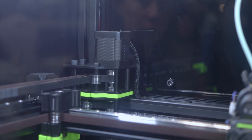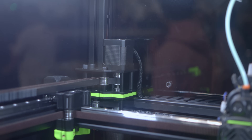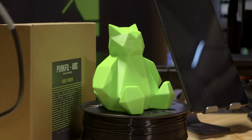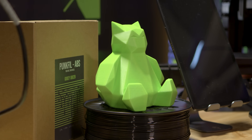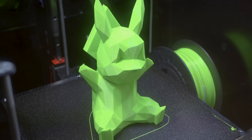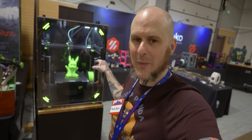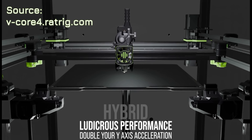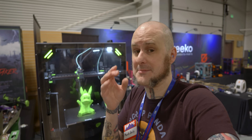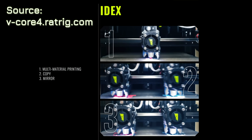To me, it seems like a bit of black magic how they're integrating two technically separate motion systems into one axis on a machine, but they've got it running here and running well. This machine is not heavily tuned — it's a prototype unit on display here at the show — but I'm not seeing any major VFA or ghosting or anything like that from these two different motion systems interacting with each other. And since you have those additional belt paths and additional motors, you can then upgrade it to IDEX, where it'll be standard Core XY on either of the tool heads, but set up for having two separate tool heads for multi-material or multicolored printing.